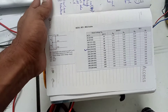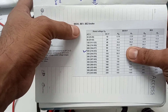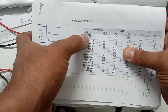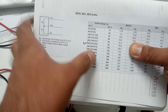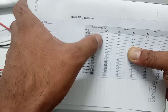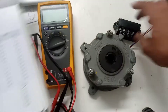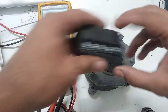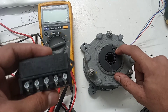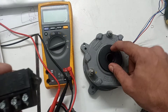We have the BE05 brake, 230 volt operated. You can see here AC volt 230 volt — so when this rectifier gets 230 volt input, it will convert it to DC at 96 volt. If we supply this rectifier 230 volt AC, it provides a rectified output to the brake and the level of the DC supply will be approximately 96 volt.